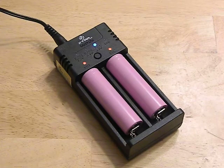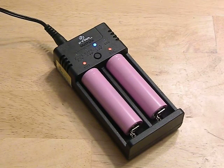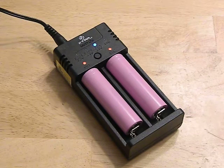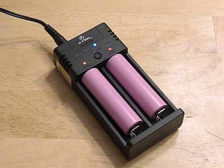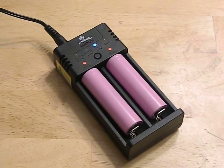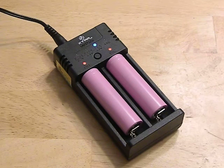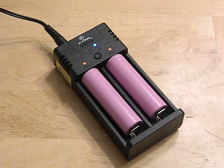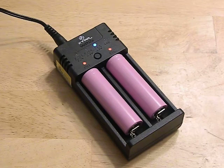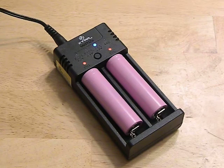It gets a lot of good reviews online, but mine obviously has some issues. Do I use it? Yes, I use it all the time, because it does have that 1A charging and it does really well in the initial stages of getting from 3.6V to 4V. But nine times out of ten I switch over to my Nitecore charger because even though it's technically slower, it charges faster in practice. The accuracy and consistency on this thing are weird, and that slow charging at the end is wacky to me.